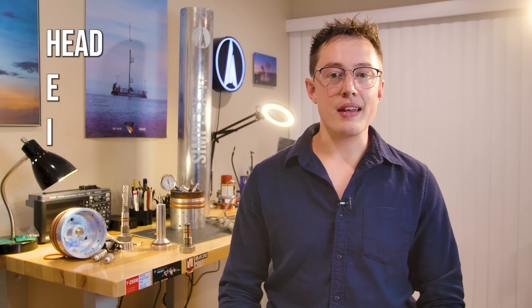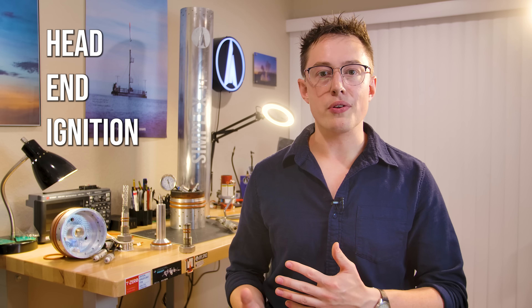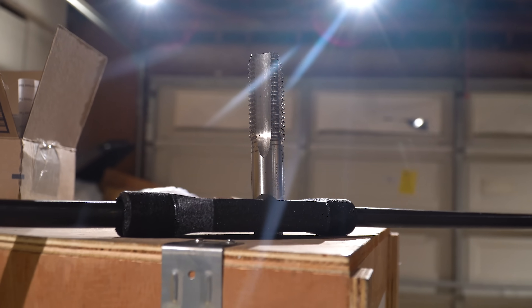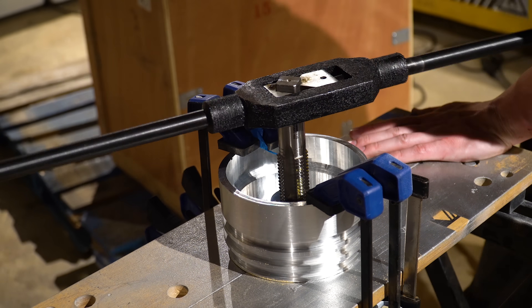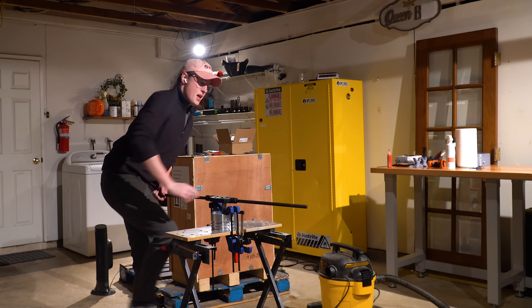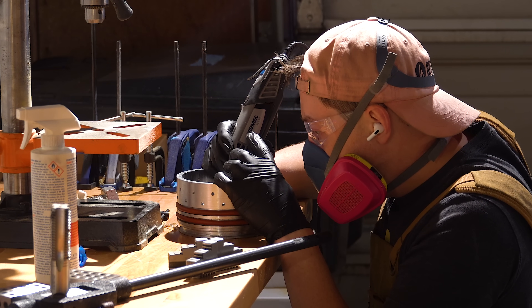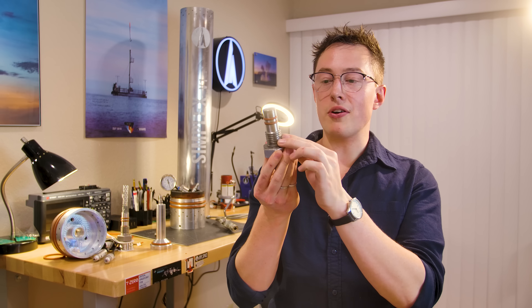Now, I've mentioned the HEI bolt before, so let's talk about it. HEI stands for Head End Ignition, and it allows us to have the best of both worlds in terms of rocket motor ignition. By using an HEI bolt, we don't need to stick an igniter up the throat of the rocket motor, and we also don't need to integrate the igniter days or weeks before we fire. We can just take this bolt out to the launch pad, screw it in, and we're ready. On the forward closure, this center hole gets coated in tap magic, and I take the longest, most terrifying and expensive M30 tap and start cutting threads with a huge tap wrench. I actually ended up cross-threading this at one point, but because the threads are so big, I was able to clean up my mistakes later using a Dremel. The HEI bolt is M30 stainless steel — I turned down about an inch of the threads just below the minor thread diameter, then added grooves for primary and backup O-rings to seal against the hole walls.